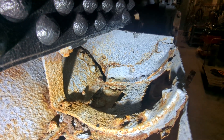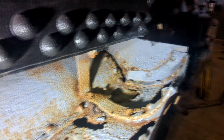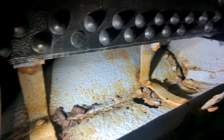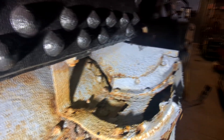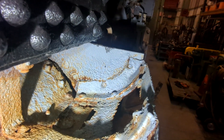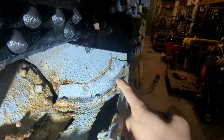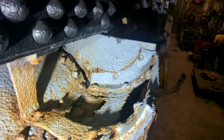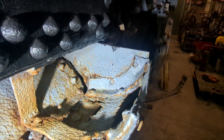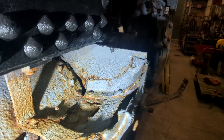Here's an example of something pretty common that can happen. I have all the hardware underneath cut off and there are a couple of bolts here, but if you look over here there's a piece of angle bolting this ash pan to the side piece. If I went to drop the pan now I wouldn't be able to because of that piece of hardware, so I have to make sure I heat those nuts off and knock the bolts through to get them out.